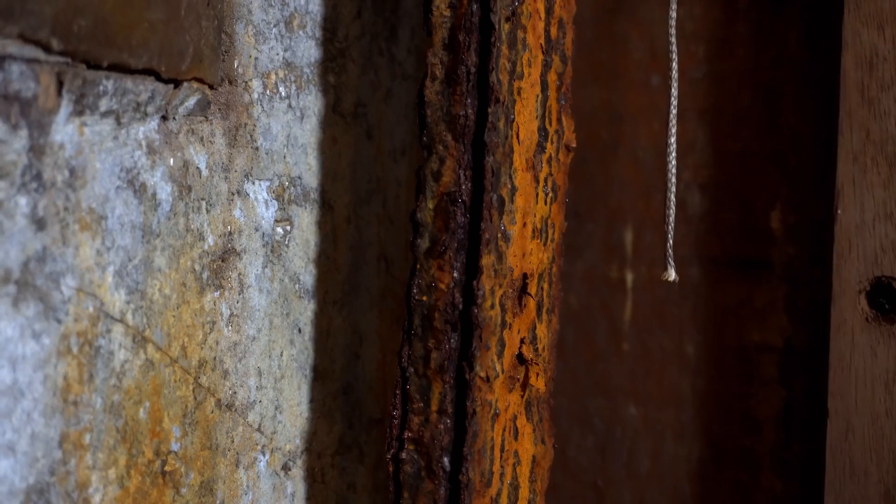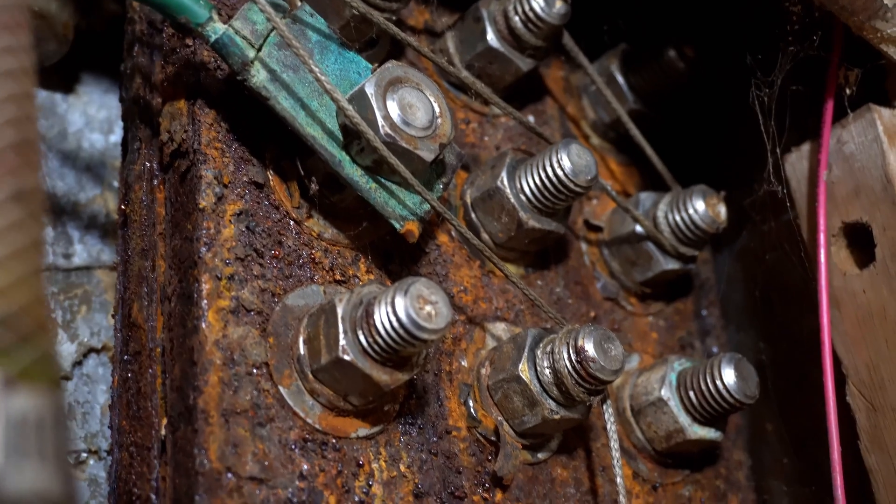So this is why we're replacing our chain plates. If we just replace them as they are, the stainless steel part isn't really the worst of it — the iron is in such bad shape. The chain plates have leaked over the years, water got in, and it just poured right onto the iron. Thankfully it's iron and not steel, because steel rusts a lot faster. Iron rusts at a very controlled rate. So we're going to be switching from this internal system and going bronze directly to the topsides of the hull.